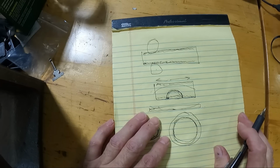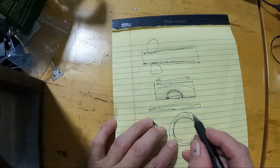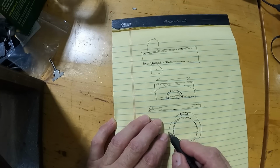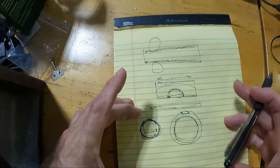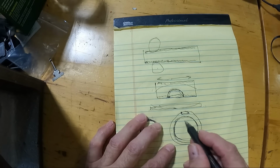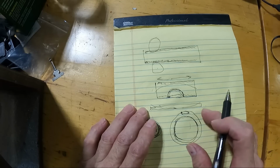And when I got the material, I told the guys it was a job for centerline. I told them, man, this part had a big keyway cut the full length of the part in the OD, and the wall thickness was maybe a half inch thick. I can't remember, but it was about 8 inches in diameter. And this ID was bored and honed to a 32 finish, and it had to be round within like 2 or 3 thousandths.